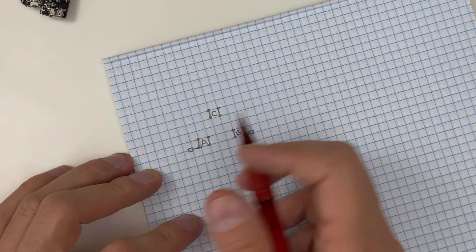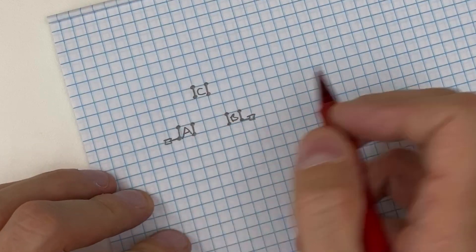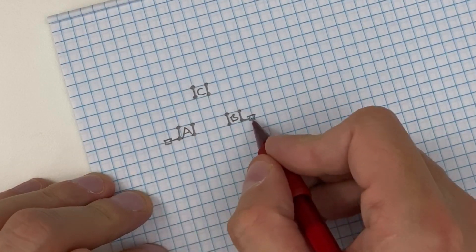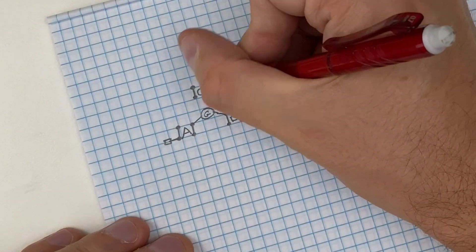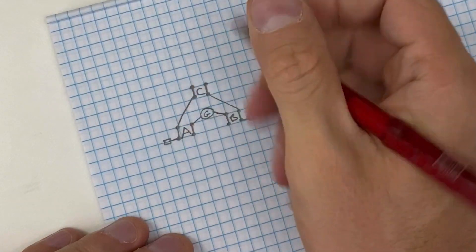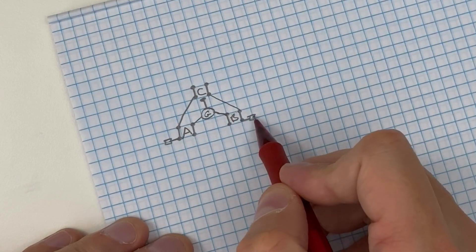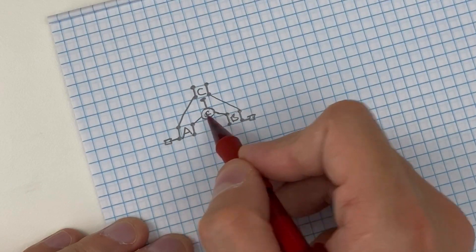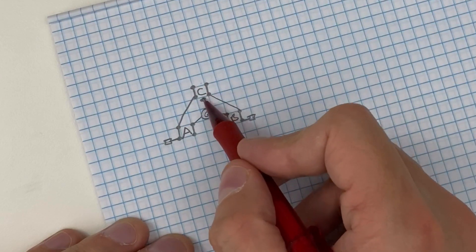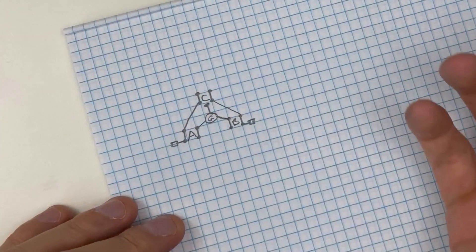For the actual wiring part, this is what I've come up with — I kind of had a hard time figuring this out, so if you have a better or easier way, let me know. So: A is the actual button, connected to the board and to ground. So A and B are both connected to ground. Then if I connect this other side to C, I need to add one extra pin to C connected to ground. Now if I close B, B is acting as an input to ground. If I close A, A goes to ground — great. If I close C, both A and B go to ground. I tried a couple other different ways, and every time I would have accidental inputs. So this is the best way I can come up with for now.